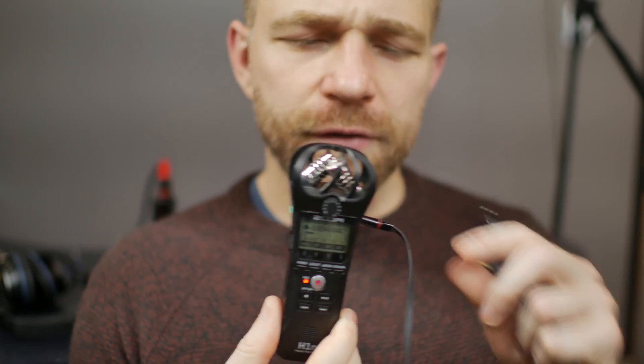I was really hoping for something 70 or 80 decibels. The next thing that was important to me was cable length — I didn't want something too long or too short, just long enough to go from my shirt down to my pocket, about a meter to a meter and a half. The next part was pretty important: a microphone that did not require an external battery pack. Many lapel microphones do require an external battery, but the Zoom H1 provides about 2.27 volts on the mic-in port, so I wanted a capsule running around 2 to 3 volts.